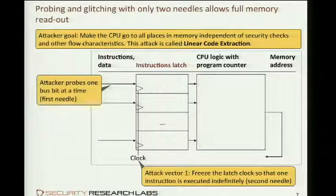And only then the instruction is moved from the input to the output, kind of like a triggered conveyor belt that keeps the output static until it receives this trigger, and whenever the trigger is received, moves whatever currently is at the input to the output.